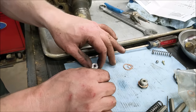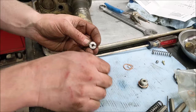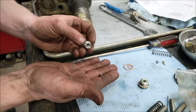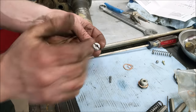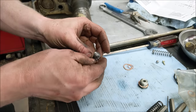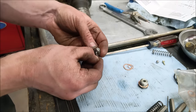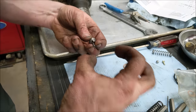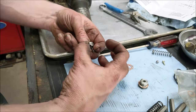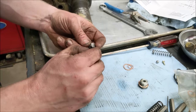Now the amazingly mysterious check ball. This assembly screws up into the housing — this is the check ball seat and this is your check ball, just this little thing. It can hold back thousands of PSI — just that ball and a little spring. Fluid can go through this way pushing the ball back just barely. Fluid flows in, and then the pressure behind it holds the ball closed. This side can hold thousands of PSI behind it with just this little tiny ball.